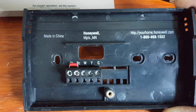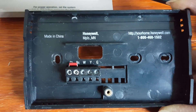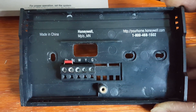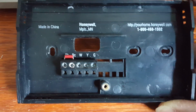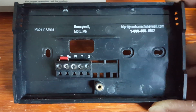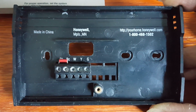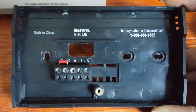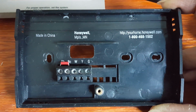There is also no C wire terminal. C is for the thermostat wire power, used when the thermostat can be powered by the wall. As indicated earlier, any model ending with a 'B' will not have a C connector, and therefore the thermostat cannot operate on wall power.